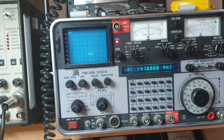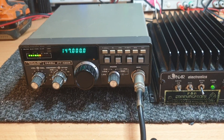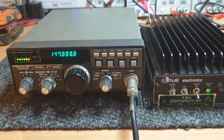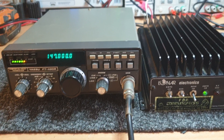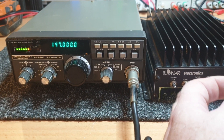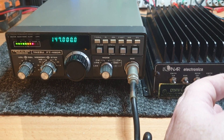Now we're going to generate a signal — about 20 microvolts as you can see — and what we want to prove here is one, that we can see a signal, and two, that we can improve the signal. I've had a lot of comments about these, and whether or not anybody really likes two meter preamps, due to the fact that most serious users tend to be using masthead preamps. Totally agree — do they bring the noise up as much as the signal? Sometimes they do, absolutely. But a lot of them don't work to be fair — a lot of them have FETs that have gone in them and you can't even get the FETs half the time.